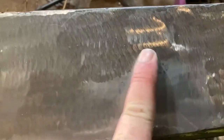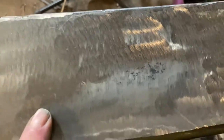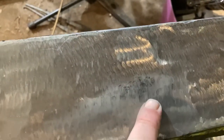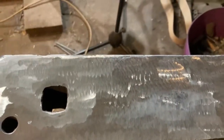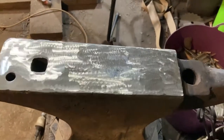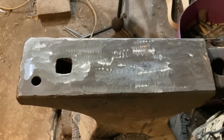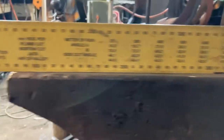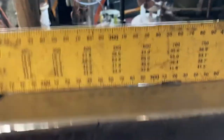Here's where I finished last night - you can see there's still a little bit there. To get much more out of that I'm going to need to take probably another millimetre or two off the whole face of the anvil, and I really don't want to do that. It's not too bad - just a few little pit marks. I'm not a perfect blacksmith so it will pick up a couple of hammer dings as I go along, so there's no point stressing about that too much. Had to knock off last night. This will test your patience, your definition of what's perfect, and your neighbour's ability to take noise. Putting the straight edge on - you can see that is pretty flat. You've got that slight little depression in the centre there, but you can't even get a thumbnail under it.